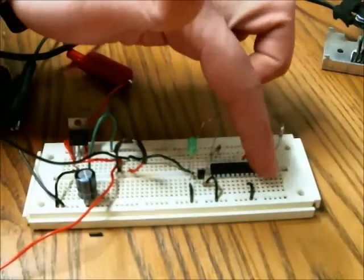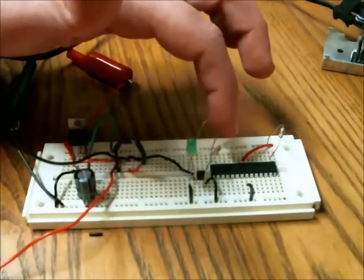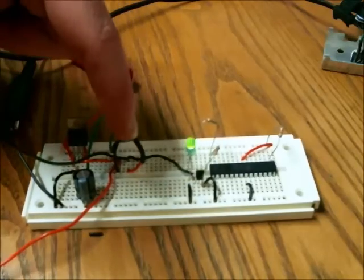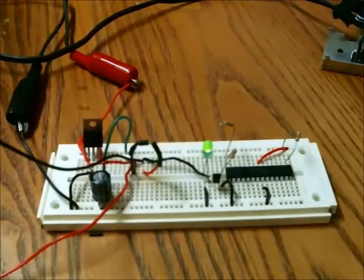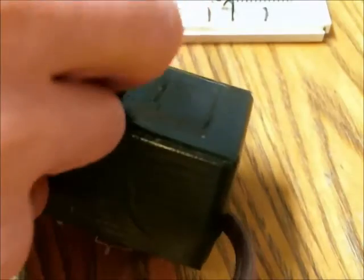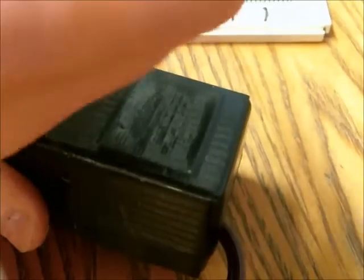I've programmed this microcontroller to flash this LED periodically, and from that same pin I've attached a resistor which goes to the base of this transistor here. From the collector of that transistor, it goes to the relay and this diode here. The rest of this is just the regulator, capacitor, and so on — nothing too complicated. I've encased the relay within an enclosure because of the 120 volts; I didn't want that to be exposed, and you certainly don't want to attach that to your breadboard. The relay is inside here — this is the connection for the coil.